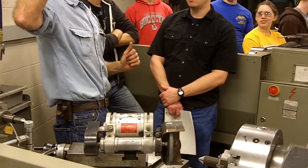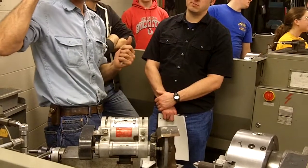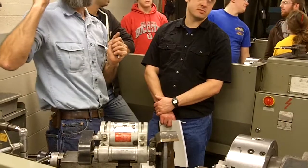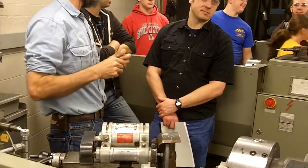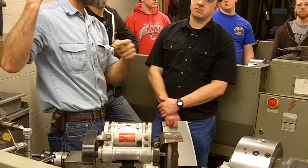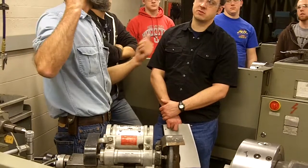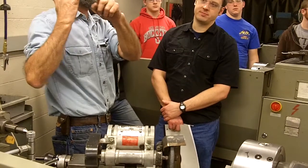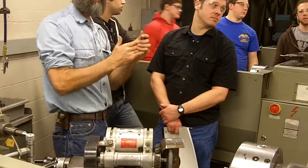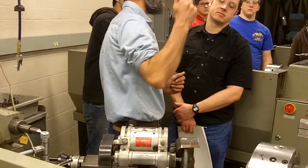Somebody used aluminum. All right? We've only got one class in here. It's like, start looking at your neighbors. Somebody did it. But anyway, we don't grind aluminum because it clogs up. The only metals we grind on the grindstones, ferrous metals, irons, steels. All right? Take a look at this grindstone, and then I'll show you with a dressing tool how we dress our stones.